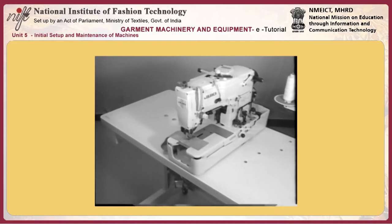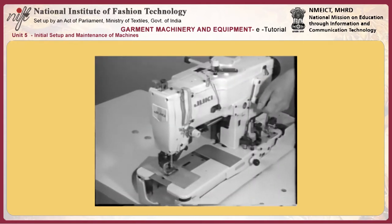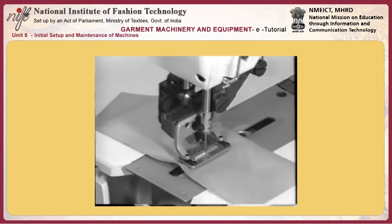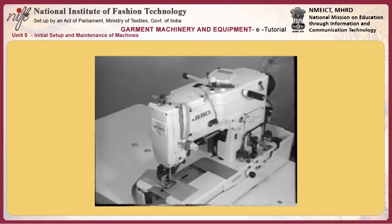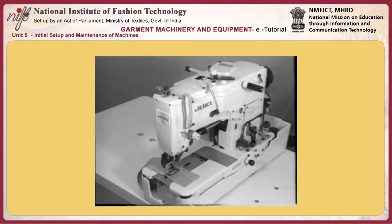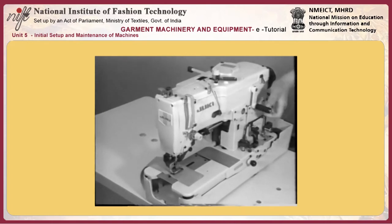If you have stopped your machine in emergency during sewing, or want to restart in the event of thread breakage from a position slightly before the point of thread breakage, turn feed handle J in the direction of the arrow to change the position of the feed. If you should turn the feed handle with the needle penetrated in the material, the needle can bend. To avoid this, be sure to turn the pulley to allow the needle to come off the material before turning the feed handle.